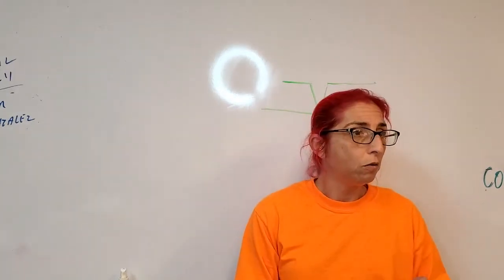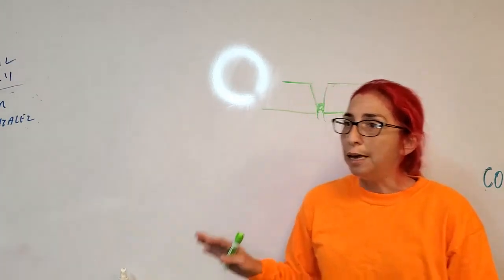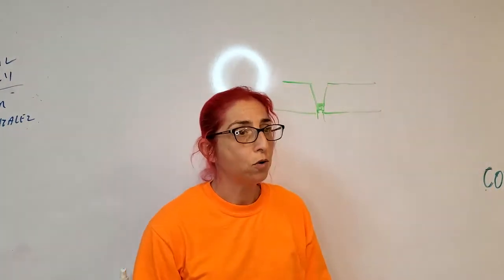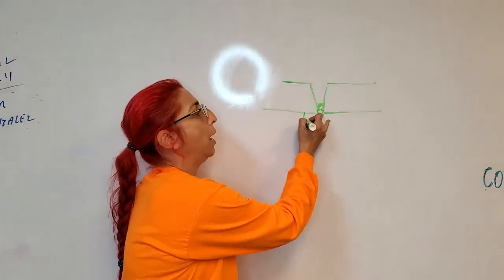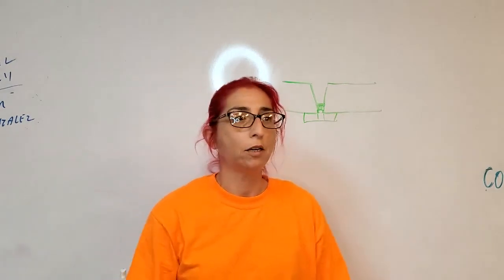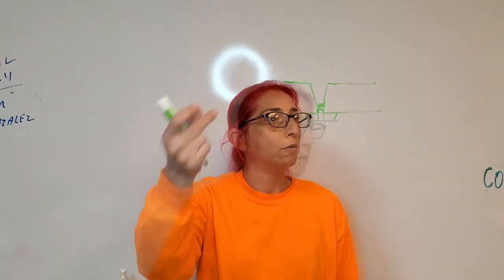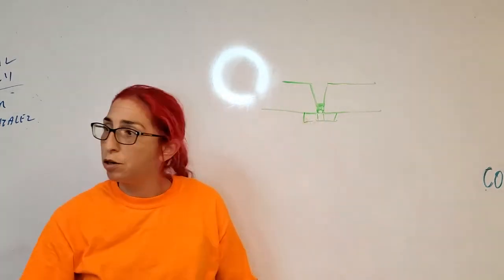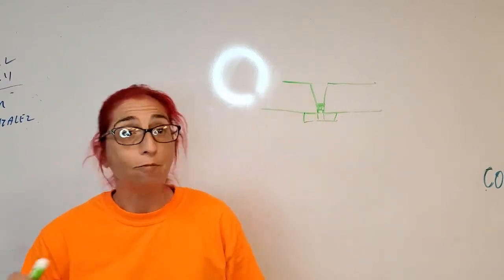Because root opening really is there so that you can access everything. You'll see this a lot on stuff that's backed, and as you go forward and take welding certs, you'll know if you have penetration all the way with that backing. You hit it with the hammer on the back and it goes plop, and then you can see that you weren't all the way down in your root, because this should take you eons to get off if you've burnt in correctly. Lack of penetration also means I may not have enough heat either.